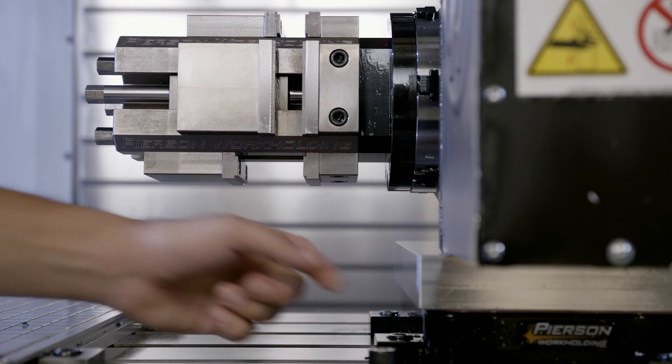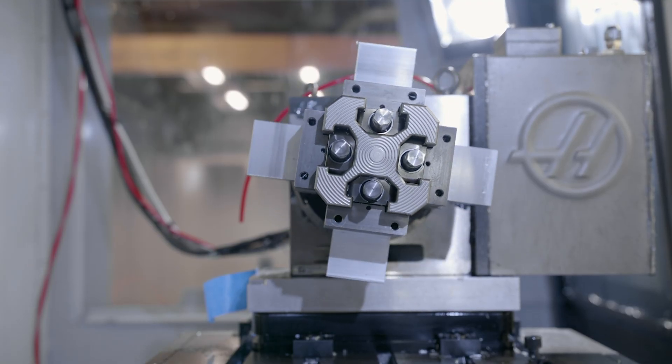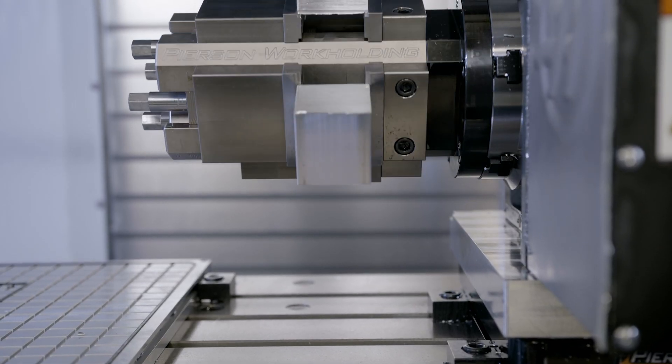We also have our smart plates. If you don't want to mount to a pro pallet system, you could use our smart plate, which also extends usable space by shifting the rotary unit outside. But we're talking about the PPS. If you do mount a rotary on a pallet, make sure the face of the rotary is just off the edge of the pallet so you don't rotate something and smack it. In this case, we have it well inside the pallet width so the roto vise can clear the pallet and the PPS base.